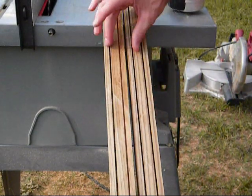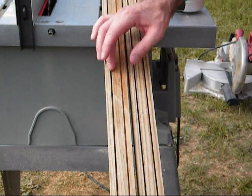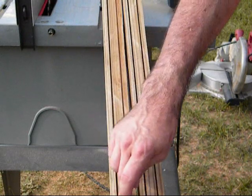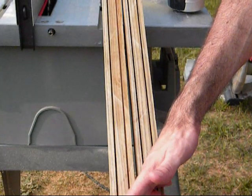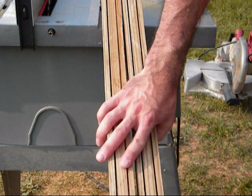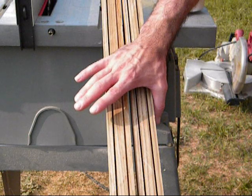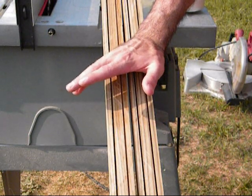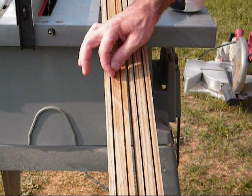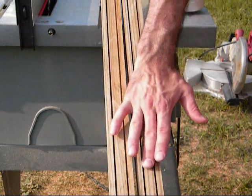I did think of something: if you don't happen to have a table saw to make these channels, you could definitely go old school. Draw a couple of lines, use a nice thick drill bit, go along and make your drill holes, then buy a good pair of chisels and just chisel it out. That's one way if you don't have a table saw. Another option might be a routing table — I don't have one and have never used one, so I'm not sure if it's a good option, but it sounds like it might work. What I'm going to do now is use the blade and eat away at the center to create a nice channel on both of these.